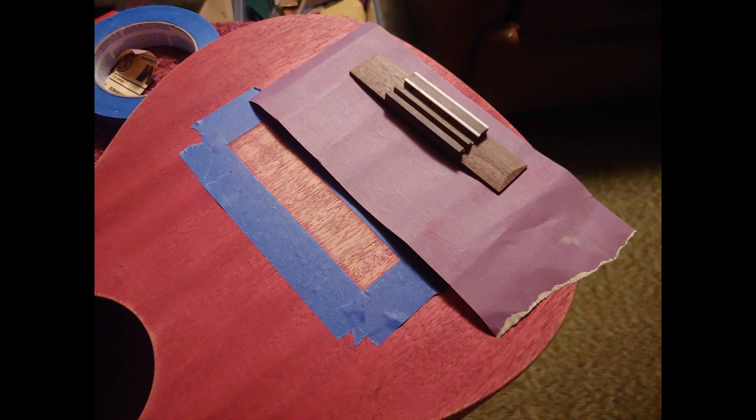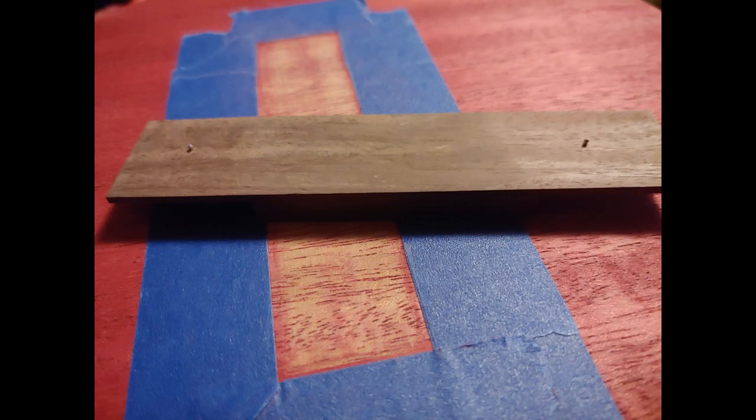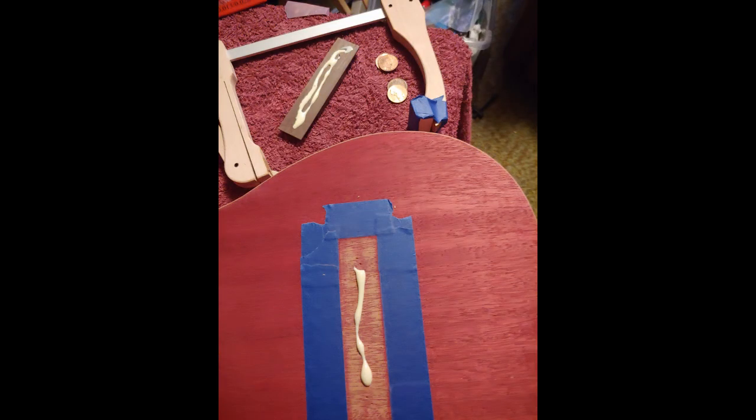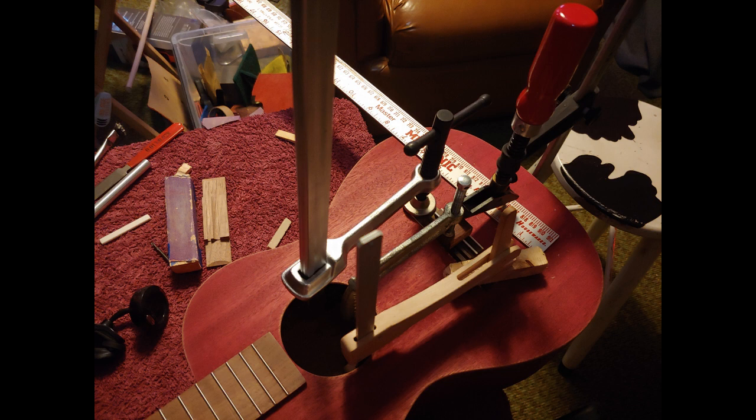I got that method from Rose's String Works — that's how he does his mandolins and I thought it was brilliant. I'm putting two tiny brads or tacks — you can see them — but I snip them off. When I go to glue the bridge it helps keep it from sliding. I've had a few builds where the bridge slides around when I'm trying to clamp it. Those two little pins totally help. I brush the area out smooth and when I put the bridge on it goes right into the perfect spot and I can just clamp it down without fussing.